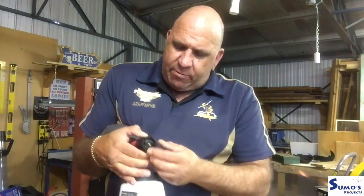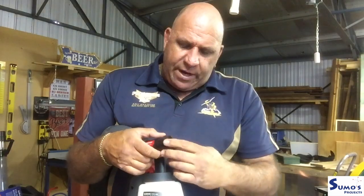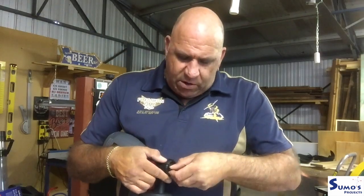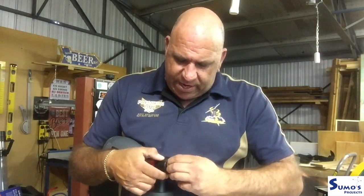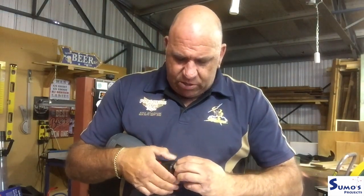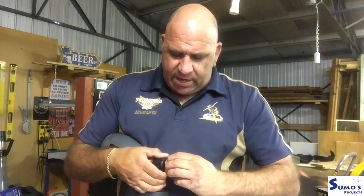With the spray fan, there are several ways to set it up. We can have the fan spray upwards and downwards, or undo a little locking nut and turn the spray head to a vertical position so the fan goes across — or on an angle for spraying a flat top surface. For this exercise I'm keeping it in a vertical position, then locking that nut back into place to lock the fan direction in.